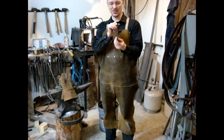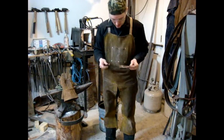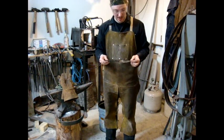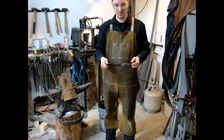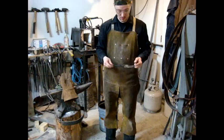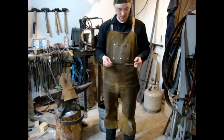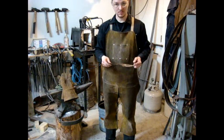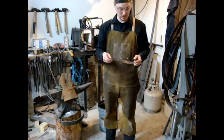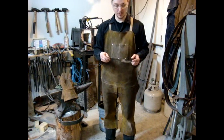This knife stayed nice and straight during the whole process. You can see how black it got — that's from the added carbon in the oil. In mineral oil it doesn't get this black. So it's a nice two-step process where you can case harden it and harden the steel at the same time. It gives it higher performance.